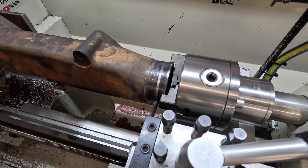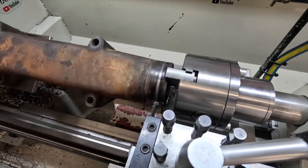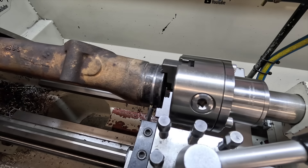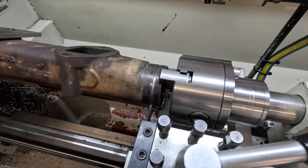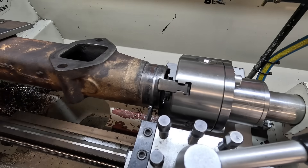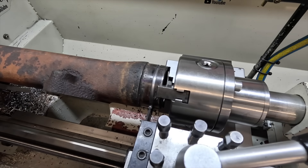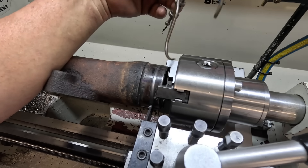There's some vibration going on. There are a couple of hard spots — one there and one there. So the only option I've got is to cut it by hand, rotate it by hand. The lathe doesn't spin slow enough to do it under power — it's too fast. The lowest speed I can go is 70 RPM, which is too fast for this setup. So we'll just have to do it by hand. I've set these dividers to the other manifold.